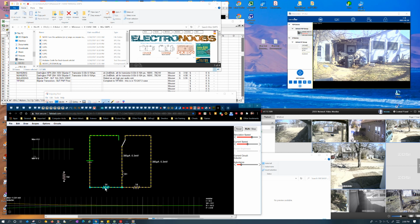But you put more energy into it with a smaller impedance than a larger impedance, because that's what limits the ultimate current that flows, which is how much DC impedance you've got in a DC circuit. That's what's going to limit how much current flows through that inductor. Therefore, it's going to directly limit how much energy you store in that inductor. And as far as discharge is concerned, you're really just doing the opposite.